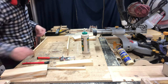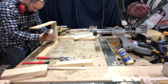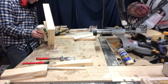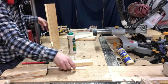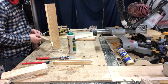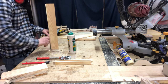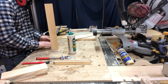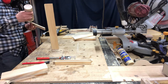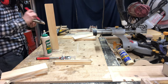I'm going to be applying some glue here to the end pieces, but keep in mind — because I want the middle slats to rattle and move around freely — I'm only gluing the end pieces into the tray itself. Everything else is going to float in that channel. If the end pieces don't get glued down it might rattle too much and your tray slats might pop out, so I only glue the end pieces in.